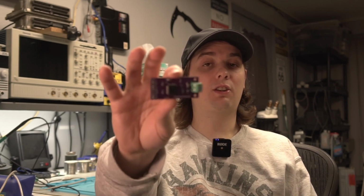Hey guys, welcome to today's video where we're revisiting this project here, which is the XC68HC58 or J1850 variable pulse width, also known as the GM Class 2 module that I did for the Arduino. This lets you do your regular GM Class 2 communication with an Arduino or any other microcontroller that runs at 5 volts. Shoot, you could even use a computer if you had an SPI adapter, so just a little USB to SPI to run this.